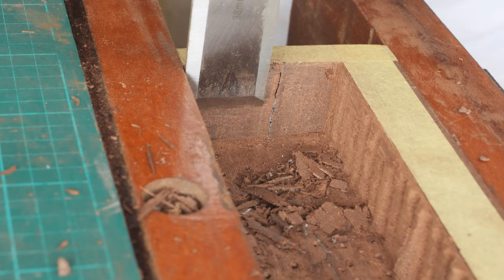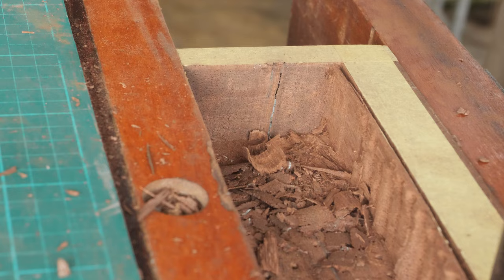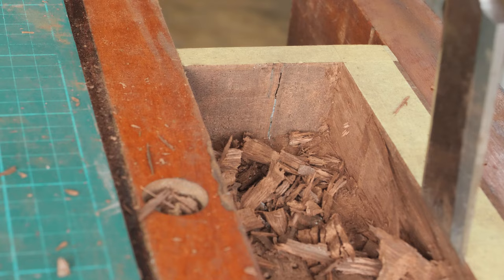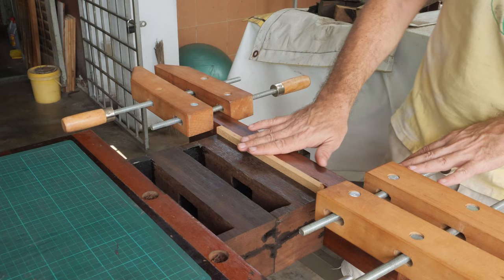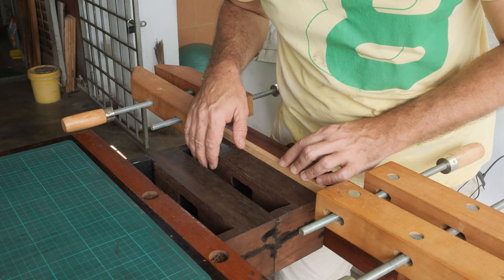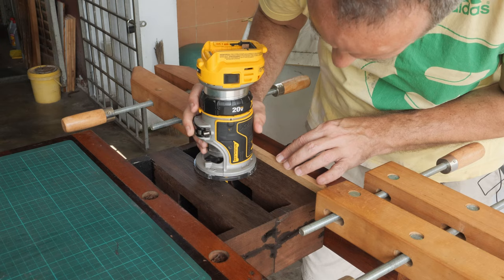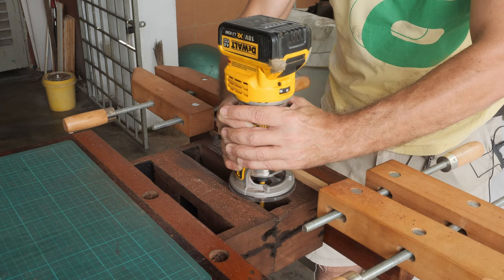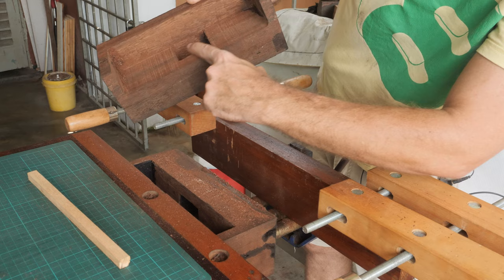Let's clean the wall carefully. Here is my setup to flatten the bottom surface — I did it by hand so it is very uneven. I have the spacer, the stop blocks, and the handheld router with the flush trim bit. Now it looks perfectly flat — just look at that.